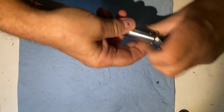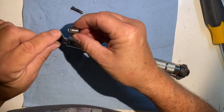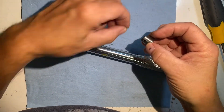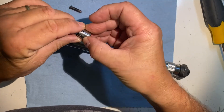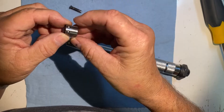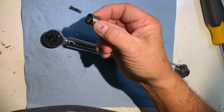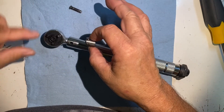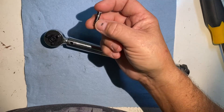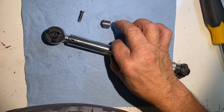The little ball bearing that we had at the end had fallen out of the cam right here. It came right out. You can stick some lithium grease in there to hold it if you want. It looks like there are two ball bearings and a pin in here — all of that moves, and even this little roller comes out. The roller is greased, so if you pack it with grease it's no big deal. Just slide that in there, maintain the relationship between the bevel of the head and the cam, then put your pin in. I'm going to head to the hardware store and get a grade-eight bolt that will fit down here to replace this ear pin, and then we should be ready for calibration.